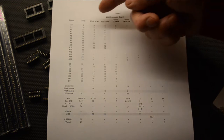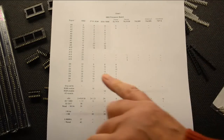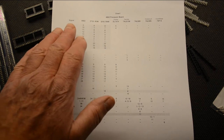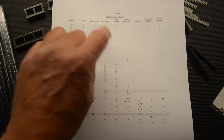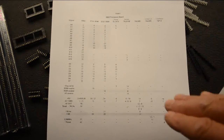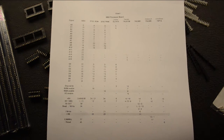The second equally important piece of paper is the netlist - that is, the signals, the IC, and what is connected to what. This simply means that if you are going to make a run of address line zero, for example, you would see that it goes first to pin 9 of the 6502, pin 8 of the 2716, pin 8 of the 2016 RAM, and pin 5 of the DL1414. That's the idea of the netlist - if you double and triple check everything on it, you'll be using this and nothing else when you come to wire up your board.